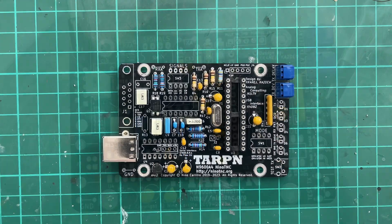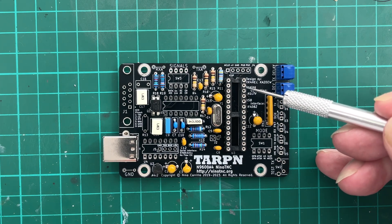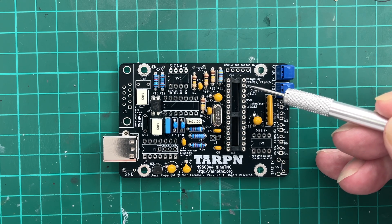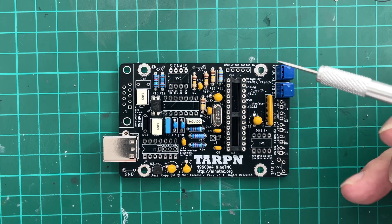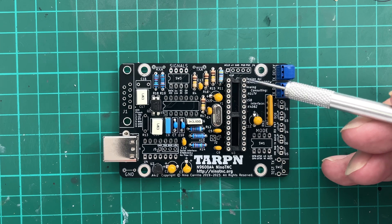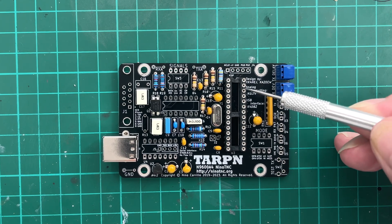Next we're going to install a bit of hardware. A little further on, I've fitted the USB socket and done the first initial test, which involves plugging USB in here. They suggest using something other than an expensive PC — some kind of wall wart, maybe a little battery or USB battery — plug into there and then you measure across these two socket points here. You're looking for something between three and three point six volts. Mine measured three point two nine, so I'm quite happy with that. The first test has passed.